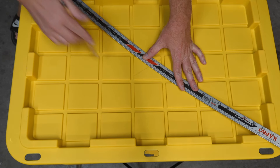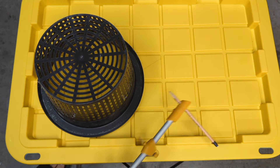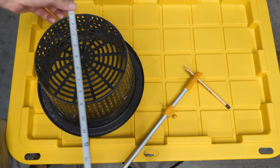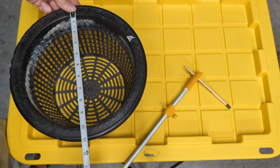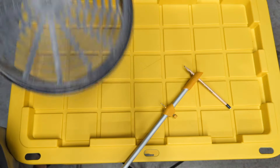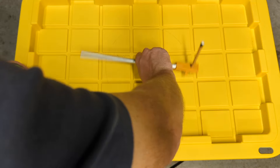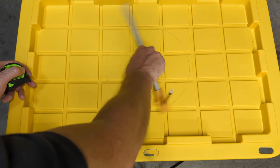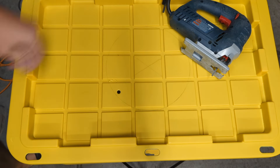From corner to corner I'm going to mark right here, so we're going to measure this up on the center. Take the net pot and measure it — it's tapered, so it's eight and a quarter inches on the bottom, ten and a quarter on top. Divide that by two: it's five and one eighth. We're going to make sure that it's five and an eighth, then go ahead and do a starter hole just enough to get the blade through.